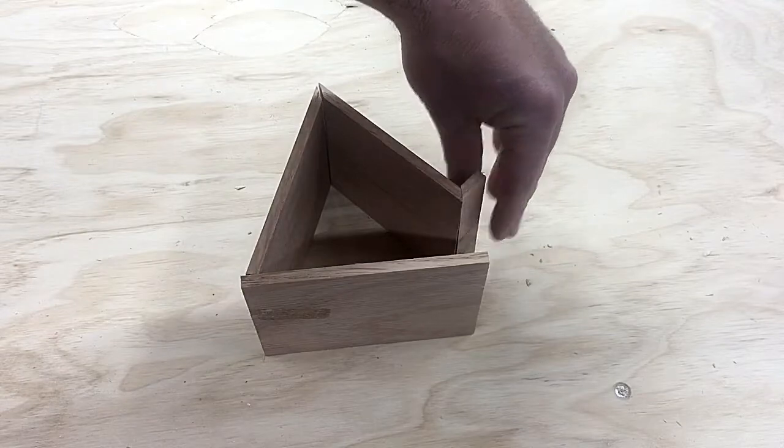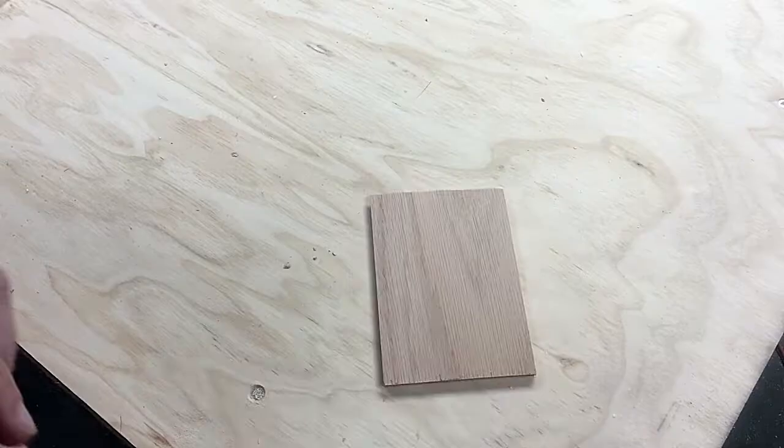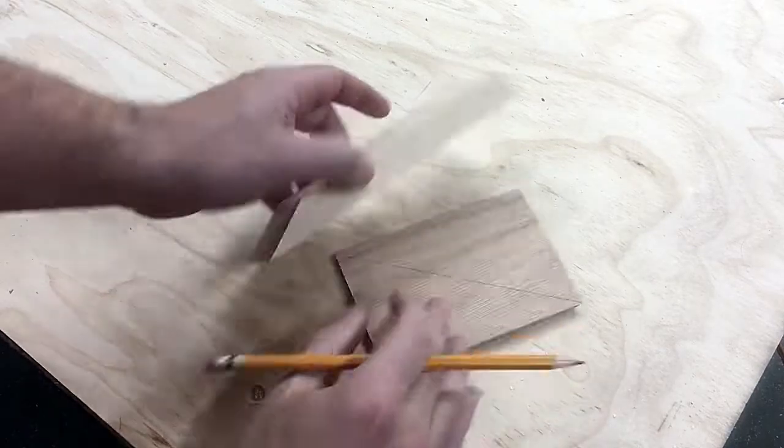Here's a layout of what the stand will look like after gluing. The angles are 15, 60, and 45 degrees. The front portion of the resting piece is not mitered. You can make both these angles 45 degrees, but I don't remember why I didn't.